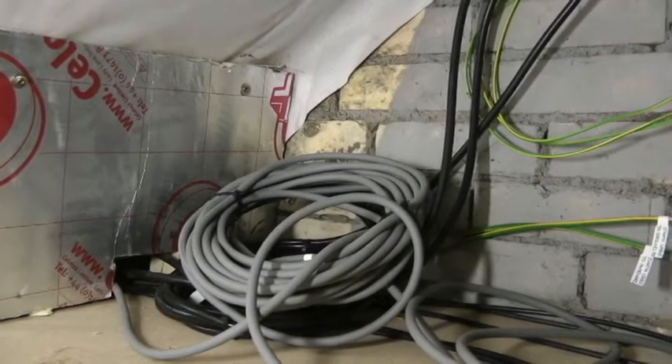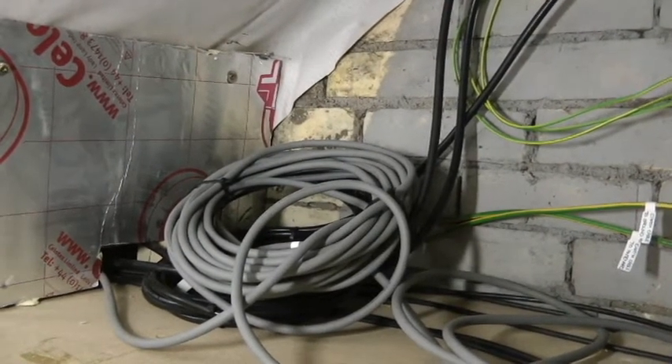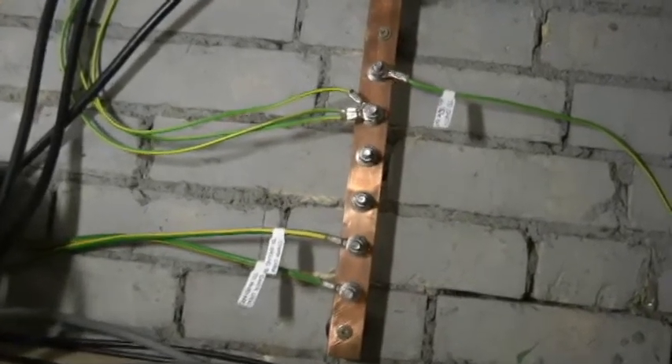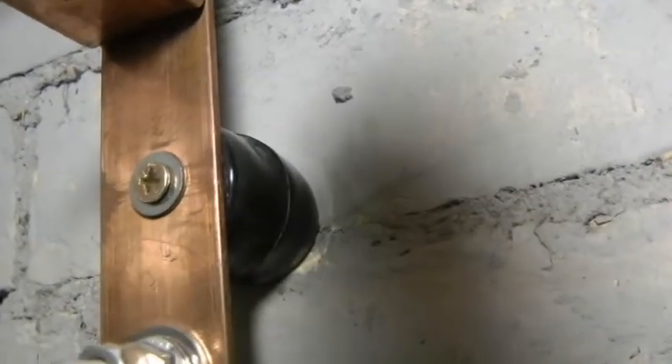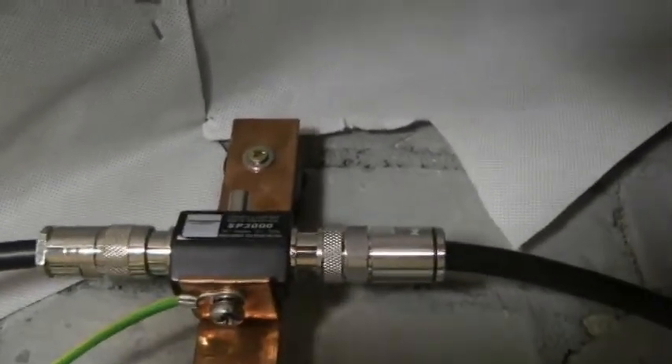The gray cable is the rotator cable — that'll be moved once I get the rotator installed. The other cables for the end-fed, the discone, and the Yagi antenna are underneath that. We've put the bracket on the wall — excuse me, it's not easy to show you. There are the door stops back to back, and I put an 80mm screw into the wall — one at the bottom and one right at the top.